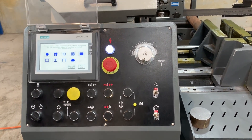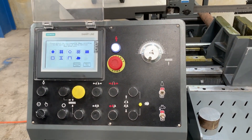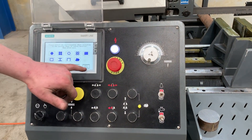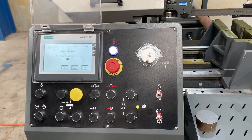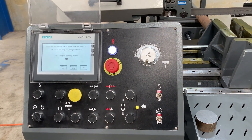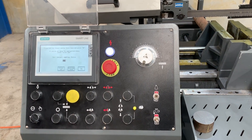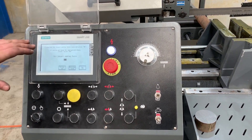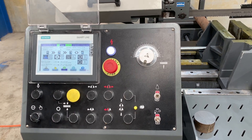Setting up variable speed, you choose a profile that you're cutting — for example, solid round pipe. Then we go to the next step where we can set the sawing force we want to use. This is something you'll come to learn — generally you do a test cut to find your sawing force and then set it up here. We'll leave it on three and hit OK. That's the sawing setup done.